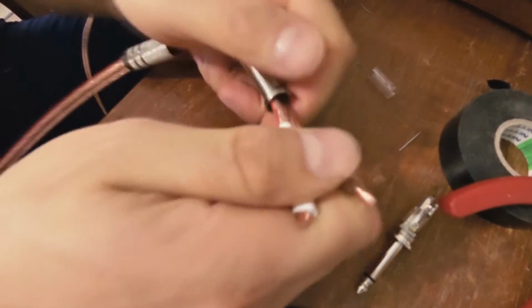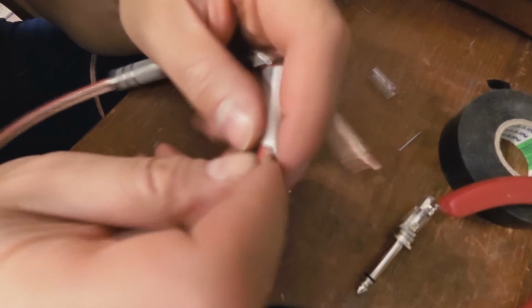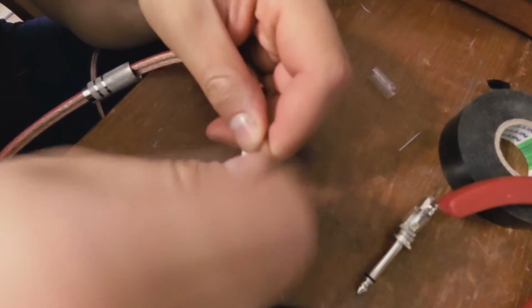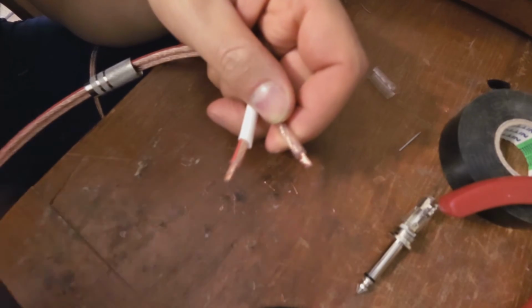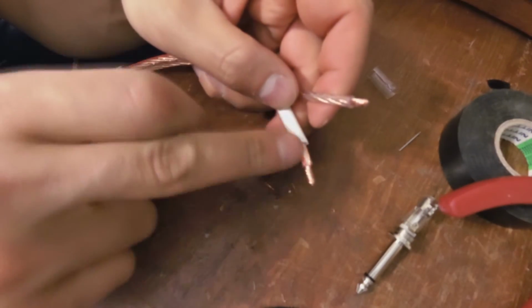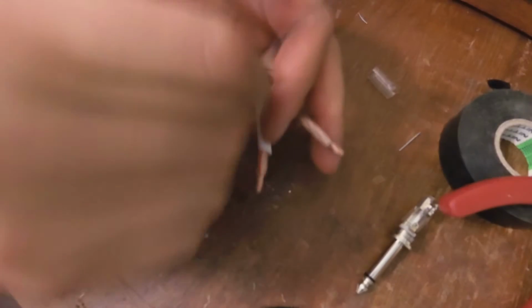And the point is to put the heat shrink on the positive terminal or the positive wire. Remember I showed you before that you decide which is the positive. In this case, the red line, so you must choose that as the positive. So you've chosen that, then you've got to stick with it. So you can't just suddenly choose this one as positive when this has got the red line. As I said, if it's only got writing on it, well then if you decide that the writing on the side of the cable is the positive wire, then you've got to keep that as the positive.